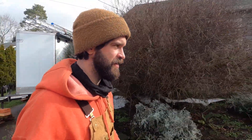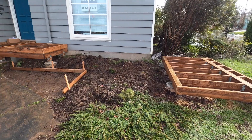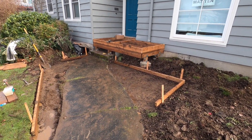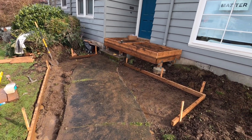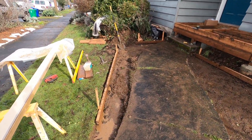Good morning guys, Boy Jacob here — it's a whole other day, and it's my birthday today. It's not raining, so that's nice. I'm doing a bunch of digging, trying to lay out the formwork for the concrete I'm going to pour today. I want to get it poured today so it can dry for two or three days over the weekend. Where our first ramp comes in we need something that's generally level — it's going to have to slope this way because that's how the drainage works and how the existing concrete works. The only thing I'm concerned about is the places where I need to overlap new concrete over this, because the thinner the concrete gets, the weaker it gets.